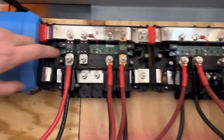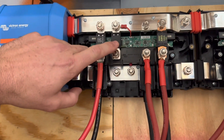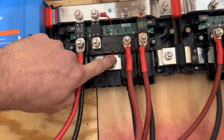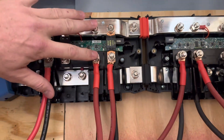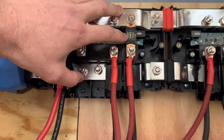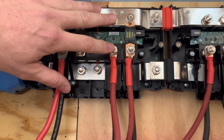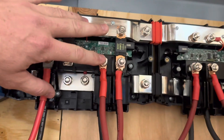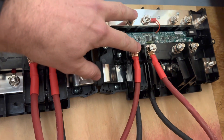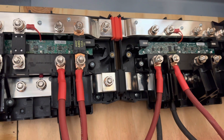This is a 400-amp fuse for the power feeds going to the inverter. This will be a ground that goes back to the case on the Multiplus. This setup is for one of the fuse blocks — it's a 100-amp fuse because the fuse block holds 100 amps. I needed a second 100-amp fuse which just came in the mail today and that will feed that part. These two are from the Orion DC-to-DC chargers and they'll both get a 60-amp fuse as well.